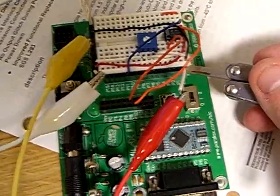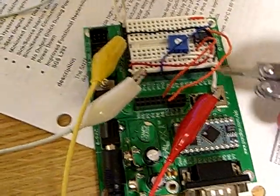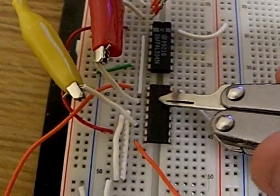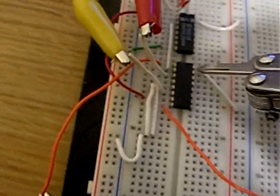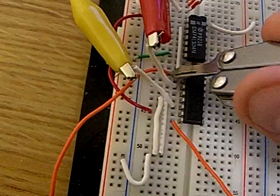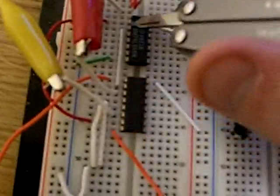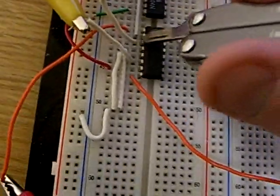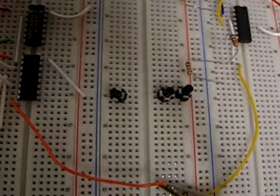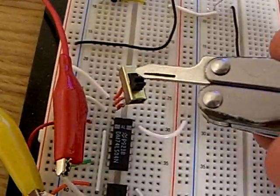An inline information output is sent all the way to the half-H bridge, which is the first top one. It powers on and off until the pulse-width modulation signal gets sent here. The NOT gate ensures that A and B are either 0,1 or 1,0. And then finally, the switch up top is directional control.